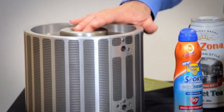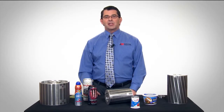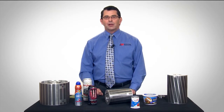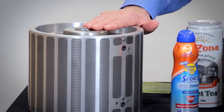That includes a thorough inspection of your magnetic cylinders for signs of rust and corrosion. Why? Because even light rust and a little bit of corrosion buildup can cause play in a magnetic cylinder. And if the cylinder has any play in it at all, the image that is produced could suffer in quality.